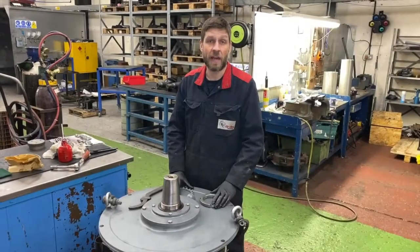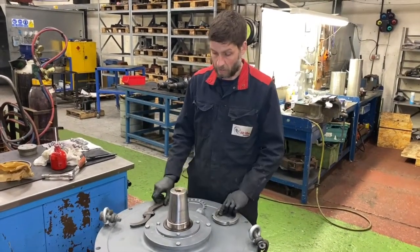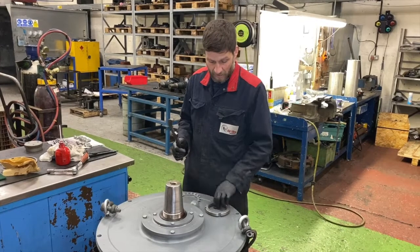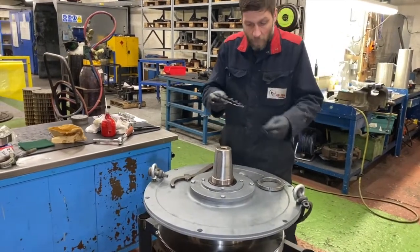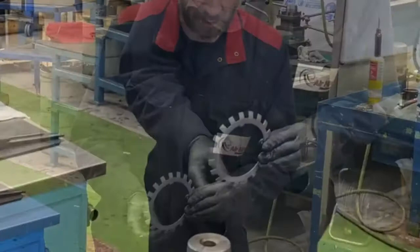Okay, so the next step, we're going to install the locking ring, the tab washer, using the correct tool. Try not to use chisels, pin punches, hammers. The ring doesn't like it, it'll be destroyed. So always use the correct tools. Okay, so the tab washer, you can see it's got a little locator on the front here, which needs to be located